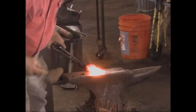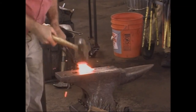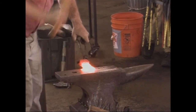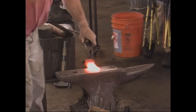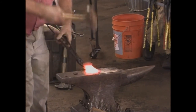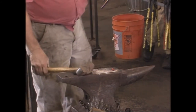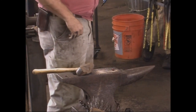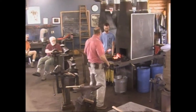Now while I have a welding heat and it's hot, I'll explain this hammer in a minute. I'm going to start spreading that just because it's convenient to do so. I think we actually overheated the steel a little bit there — you can see that's crumbling. I'm not going to pick it up, but you can see we're crumbling the edge. I'm hoping what is trapped between the mild steel is in better shape than that. That's part of the problem with using an unknown steel that you've never worked with. So we're just going to set this on the fire, take our break, and see you in about 10 minutes.